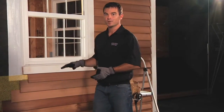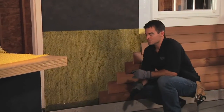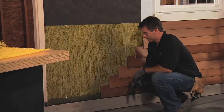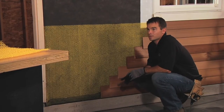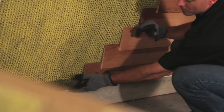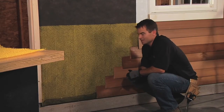As you can see, we've got a partially finished rain screen wall here. Let's focus on the bottom detail. It's really important when you build with rain screen to keep an opening at the bottom for drainage and ventilation. If you're also concerned about insects crawling up into this airspace, make sure you use a window screening material. We offer a product called Slicker Screen — it's six inches wide. You wrap three inches around the Home Slicker on either side, and you've got a good barrier for bugs, as well as an opening for ventilation and drainage.